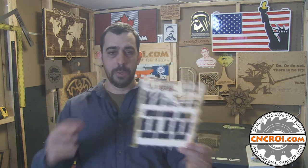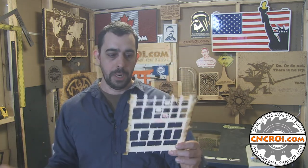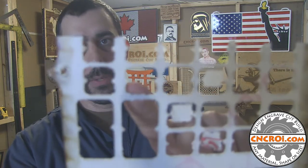Another option for polycarbonate is water jet. Every tool has a plus and a minus. The laser really uses all the material because you don't have to account for material moving, but the problem is the heat. With the router you use more material but you don't have the heat issue, though there's cleanup because you have to remove tabs. With the water jet you also have tabs to sand, and the water shoots down and sometimes comes back up — if you have a large sheet it starts to vibrate. Each machine has a plus and a minus; there is no perfect machine.